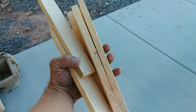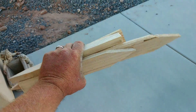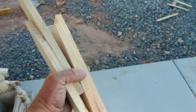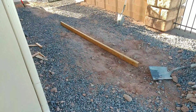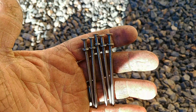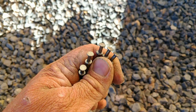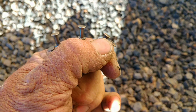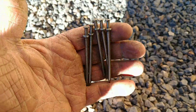These are just regular wood stakes — they're a foot long and you can get them at a Home Depot or Lowe's. We're forming most of it up with regular 2x4s. These are 8-penny duplex nails; they have a double head so you can drive them into the wood and still pull them out really easily. It's not like framing — you're going to want these easy to pull.